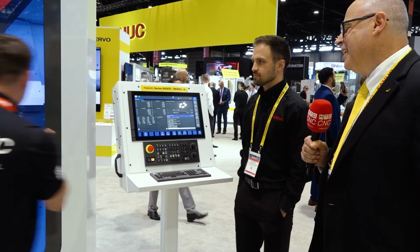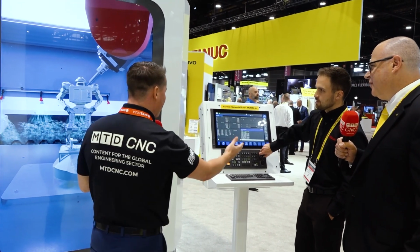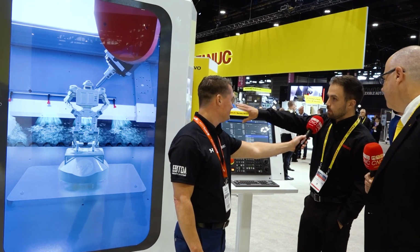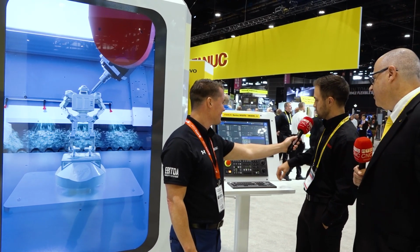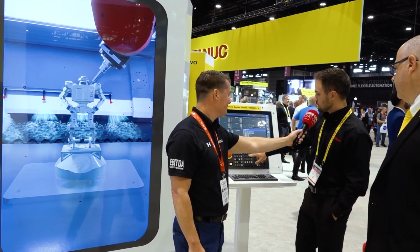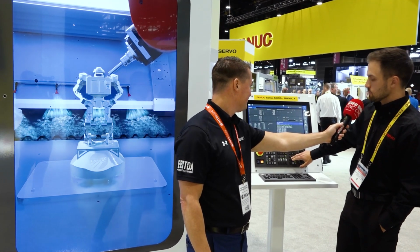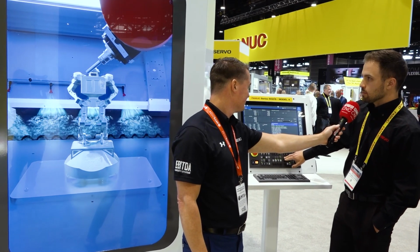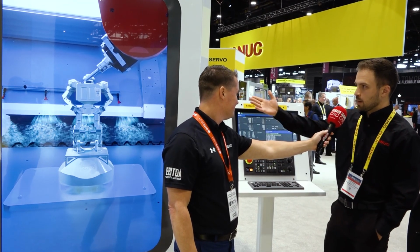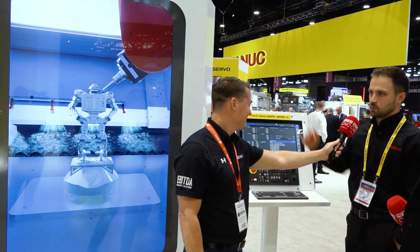So let's prove that this is not just a video. Let's speed it up, slow it down, make some adjustments. What do we have going? Feed rate, we just turned the feed rate down so you can see that the video actually stops, so it's a real simulation. We can turn it back up, you can see it start back up. And then we can actually go into jog right here and move the axes around. So we can move this, bring this over here this way, and then we can actually start it back up. It'll go right back into the process. So it's definitely not a video. We're actually simulating what a real machine would be doing.